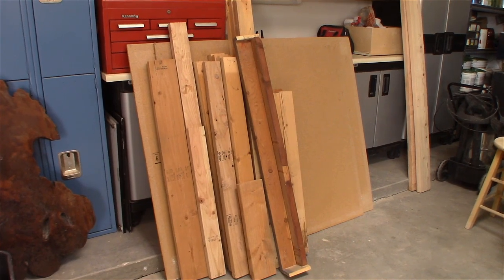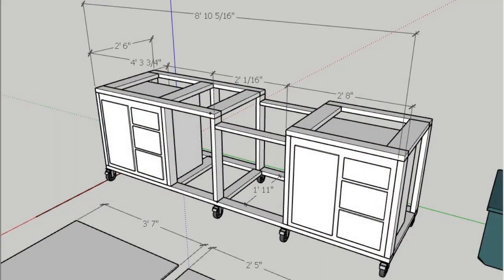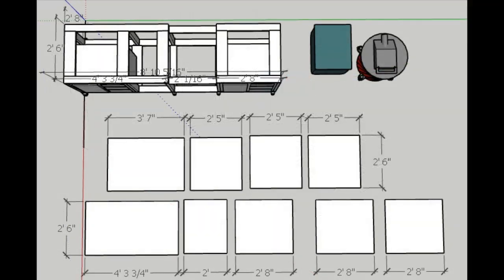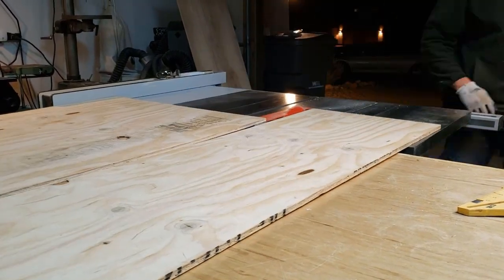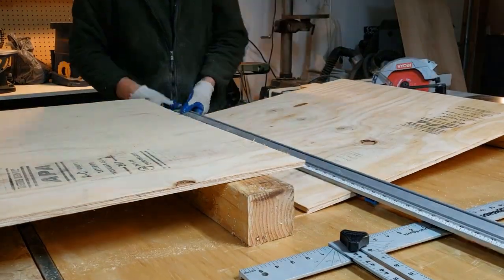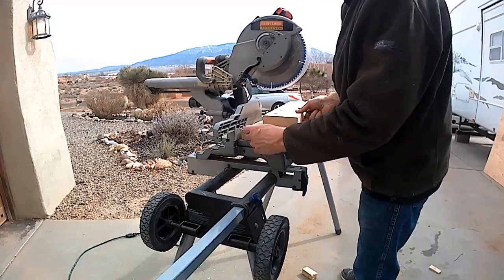Since it's workshop furniture we don't have to go overboard on wood, but I definitely want the top to be nice, straight, and flat, so we're using maple for that. I started out by using SketchUp to lay out the cabinets and the frame. I also laid out all the flat pieces I needed to cut from the full sheet of plywood on the floor to figure out what we needed. Then I ran my three-quarter-inch cuts for the boxes and got to work cutting all the two-by-fours and two-by-sixes to length for the frame.